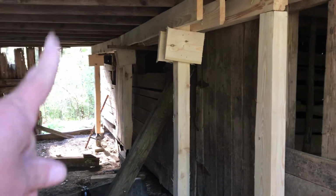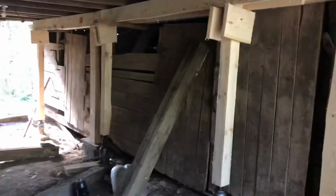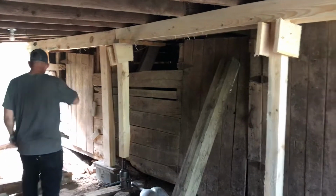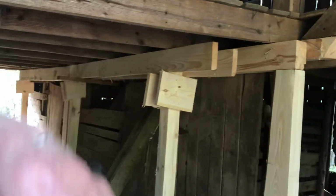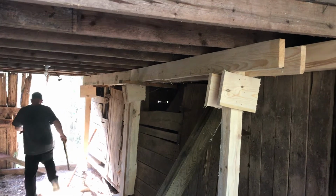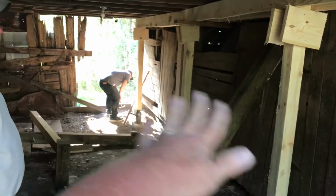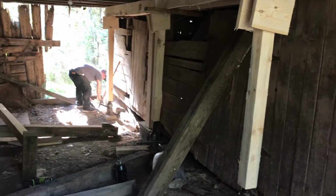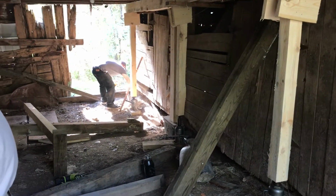So now you've got to put the last support on the far end. Yep. So this old beam actually will not really even be worth anything from that point down. Well, it will. I mean, he can take the center beams out. That beam right there is actually sitting on a good foundation. Right. But he can actually take these inside walls out over here and make open space. Yeah, because that's just swinging there. Yeah, if you look at these doors, the doors ain't sitting on the ground. They're not even hanging hardly anywhere. They're just kind of sitting there.